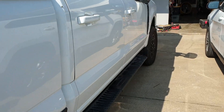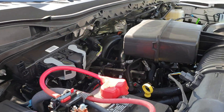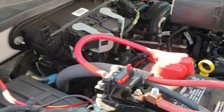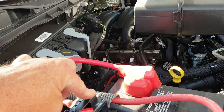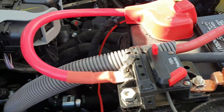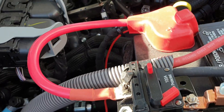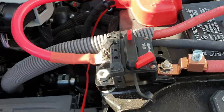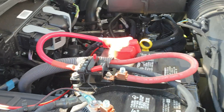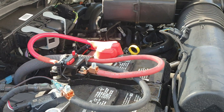It's just sitting there running. This inverter has a low voltage cutoff that'll kick out just before it drains the battery totally. And there's the breaker that turns it all off. I kind of like how that mounted — I just mounted it to the mounting post, so if I need to work it I just take this one post off and it'll swing up out of the way. If you have to change the battery out it won't be too much pain to get it off there. And there you go — that's it, we're ready to plug the thing back in and get her going.